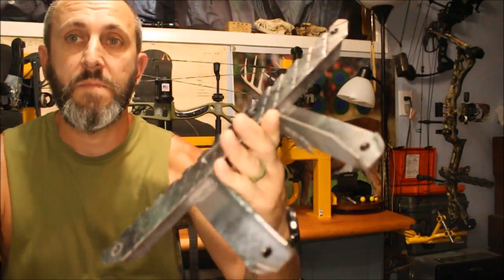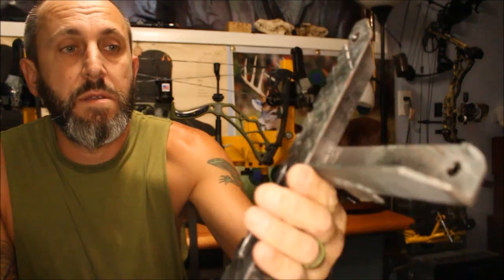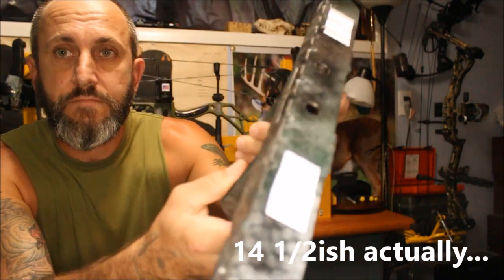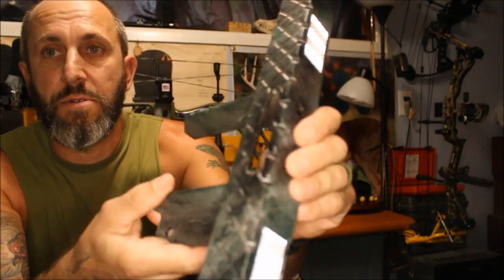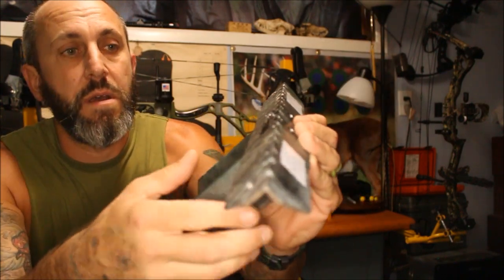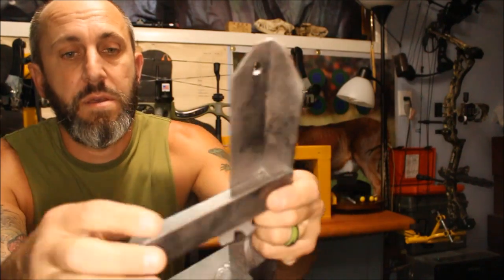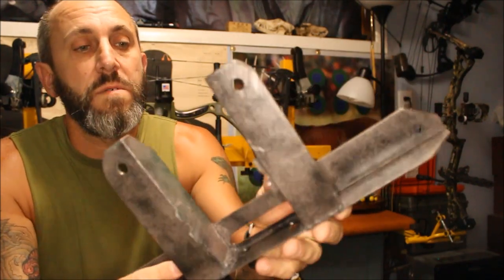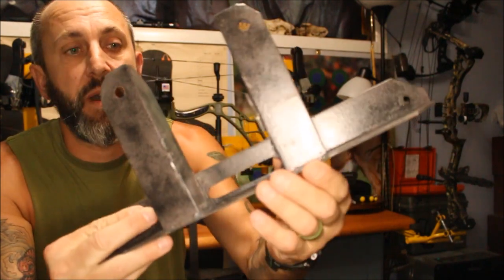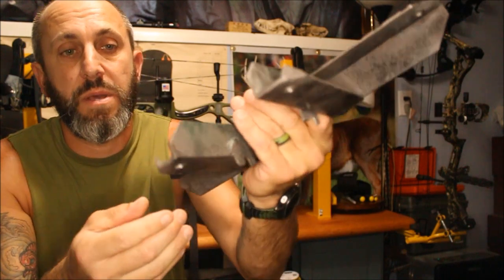Here's the platform. It's actually a piece of inch-and-a-half angle iron that I cut to fifteen inches on the front here. I ground grooves in the top for traction, I rounded the corners, then I just took the measurements off of a step and I welded this into place here, along with the inside and the bottom edge. The idea of this is that it would slide into the step.